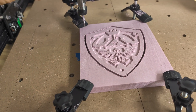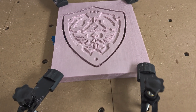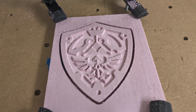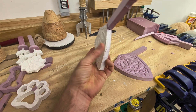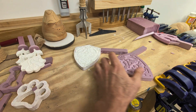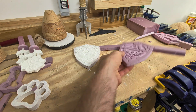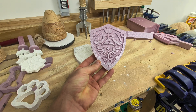So this all started by me carving out a shield with my CNC router. I carved it out of polystyrene XPS foam. I made two of them and this first one I coated with a layer of plaster or drywall mud — just regular joint compound. The second one I saved for you guys; I didn't coat this so I can show you the process of coating it.